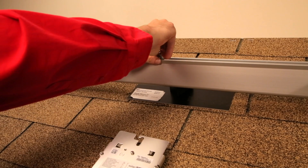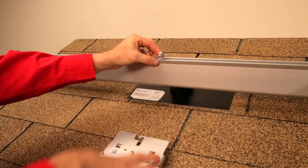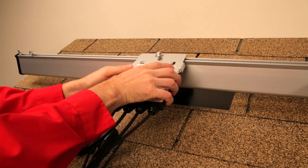If you have any questions, SolarEdge provides an app note that you can download. The most common way to ground the optimizer is with a star washer, which is supplied with each box of optimizers.